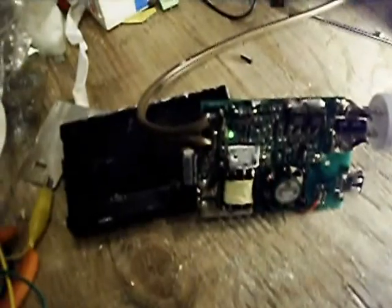Now to see if this thing works — and here you can see it working, running a little Phillips LED lamp I had lying around as a spare. There's also a little green indicator light on the back of the PCB that would ordinarily shine through the lens on the case, and a white dot next to it is a red LED that lights up if there's a fault condition. So the thing works. The fan might be blocked by something but I don't want to fiddle with it because there are lethal potentials on that board.